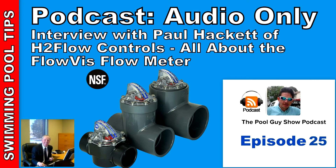If you're going to purchase a FlowVis, is it easy to install? For new construction it's very simple — no more difficult than installing a two-way valve or a 90-degree elbow. For retrofitting, I wouldn't say it's a challenge, but you do have to deal with one issue: you need to cut out a section of pipe just big enough to fit the FlowVis, and if you cannot spread the pipe to allow it to fit, you'll probably have to put a union on either side. Again, not a difficult thing, and in some of the northern climates those unions can enable you to take it out during winter.